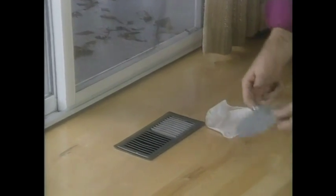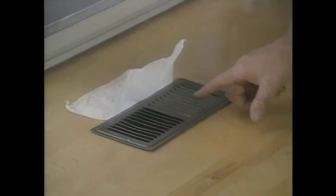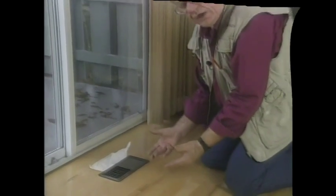Now what I'm going to have to do is go down into the basement and adjust the damper. There you have it — I have adjusted the damper to about a 40% reduction on air flow, giving a nice even flow here at the register into the dining room, not causing any draft.